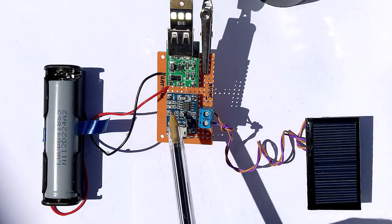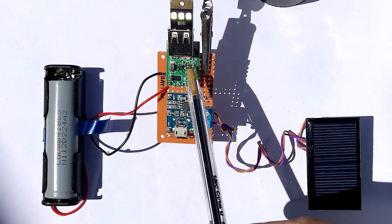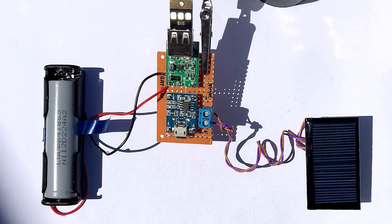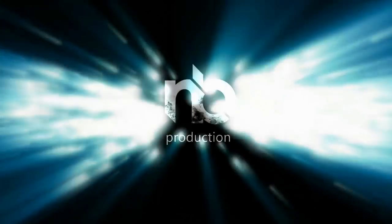This project will be very helpful for powering a remote data logger. Power supply is always a problem for a remote logger since there is often no power outlet available, forcing you to use a battery that will eventually die. Our inexpensive solar charger project is an excellent solution. It can also solve the efficiency issue of Arduino in sleep mode — sleep saves battery, but sensors and power regulators still consume power in idle mode. By charging the battery as we use it, we solve that problem.